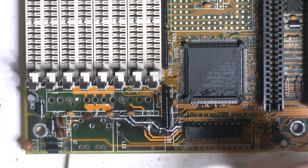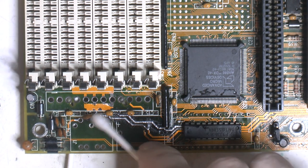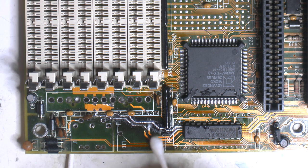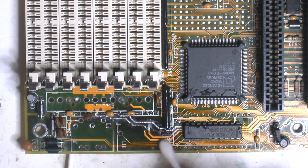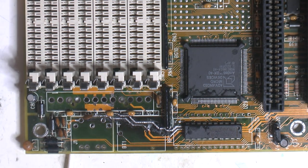But I don't think this is like the green stuff Rossmann uses, for example. I didn't have much luck with it for fixing stuff when you pin something down, because it turns into more like silicone in the beginning, so it just drips, but it gets hard later. So it's more like an I'm-done kind of product, to protect your stuff. Probably good for RC cars and stuff where you might want to coat your servos or something.